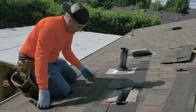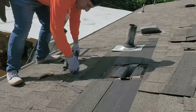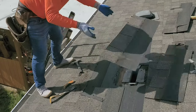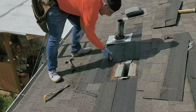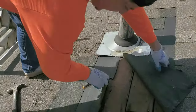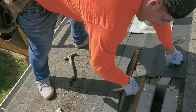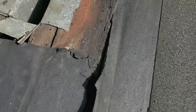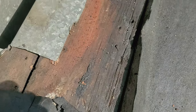Take this one off too. Sometimes when you get up you can just ever so lightly pull them back. What you don't want to do is rip the shingles. So far so good — no ripping shingles. Now what we see is — we don't know. So good thing I do have a little bit of paper. Let's cut into this and see. This water will come on this and run, and it looks to me like something is leaking right in here somewhere. Looks like there's moisture right here — see this? See the little shiny? Watch — see that right there? It doesn't look like much but it's changing color. The water's leaking off one of these nails probably.